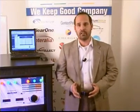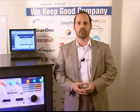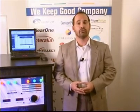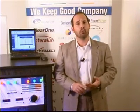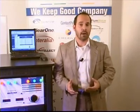We've recognized this, and we've come out with a complete line. We have units that range in length from 19 inch all the way up to 62 inch in length. We also have units that have amp meters on them, so if you need to see the power draw that all the equipment is pulling from the rack, you can do so. You can also get them with surge protection if that's necessary, and you can also get them in a 1U mount, or even a 0U mount if you want to run it down the rail so it doesn't take up any of your precious rack space.